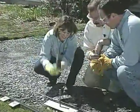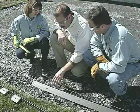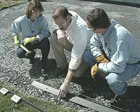There we go. Bring your landscape, mulch, or grass right up to the paving stones. The edging will be undetectable. If you remember earlier, we dug the base 6 inches beyond what the finished edge of the patio is going to be. Now you can see why we needed to have that area to accommodate the edge restraint.